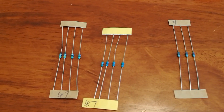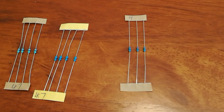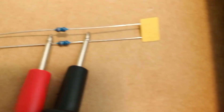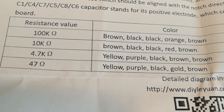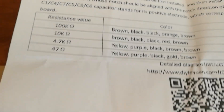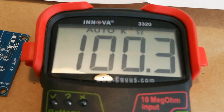On this board it doesn't come with a lot of resistors. There are two sets of four labeled 4.7k and 47 ohm, three resistors which are 10k, and then two resistors which are 100k. It's pretty simple by process of elimination, but I just want to make sure they gave the right ones. It's almost impossible to see those color codes, so I just hold the meter to each one and read it to verify. These are my 100k resistors and I'll start with those.